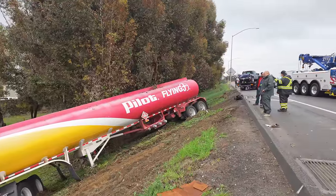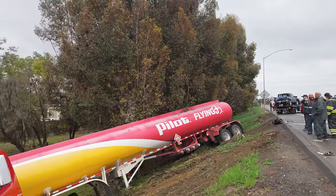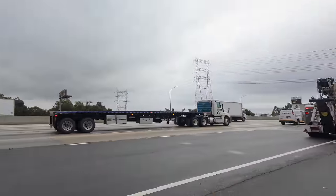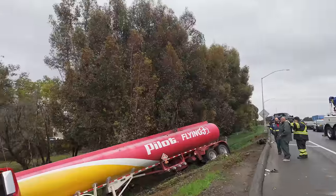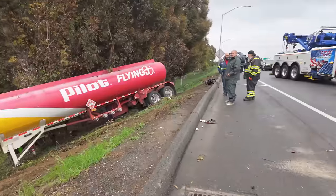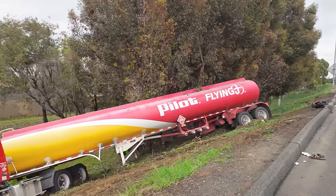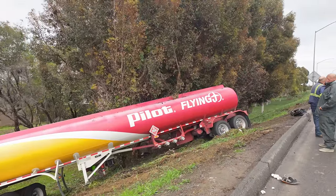So another way to alleviate that is to just attach with the rotator the rear and follow him. But as the wrecker all the way up there winches it all the way forward, the rotator will run out of boom. You'll have to keep re-rigging. So that's why I'm here. We're just gonna bring up the whole baby and put it right here in one smooth shot. Should make for a nice video, some good teamwork, and we'll get it done really quick.